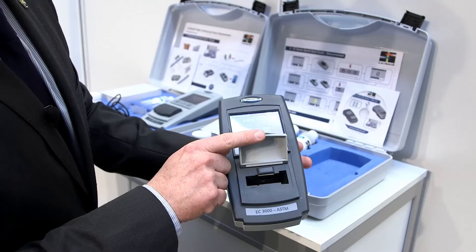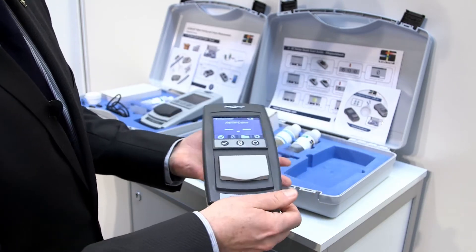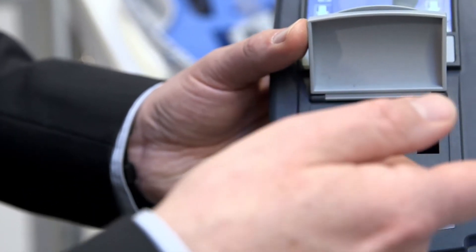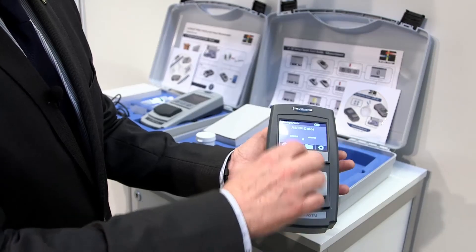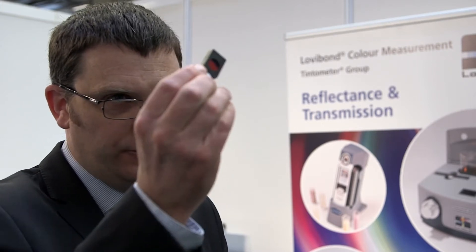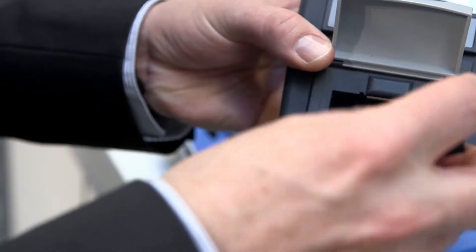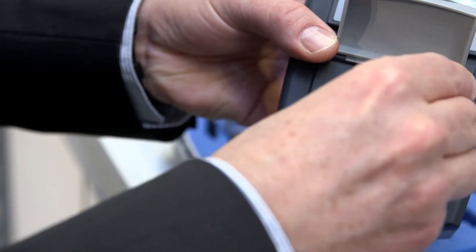The unit is powered by USB or by AA batteries at the back. To take a reading I can simply take my cell with my liquid in it, position it carefully — it's held tight by a metal clip very securely — pop that down and press the read button either on the button or on the screen. Or if I want to check my reference standard I can remove my cell; it's impossible to put that in incorrectly. I can pop that in and simply press read.